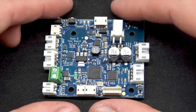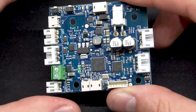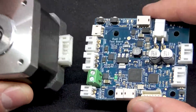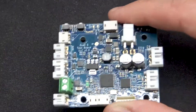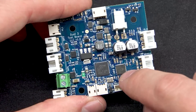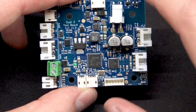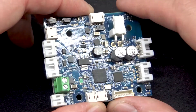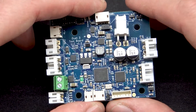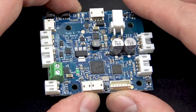Going up close and personal, you can see it's a small little board spanning 47 by 54 millimeters. Comparing that to a NEMA 17, you can see it easily fits on a direct drive setup. It has an ARM Cortex processor to control everything on the board and a Trinamic driver for your extruder motor. The connectors are quite different and I'll get into that in a moment, but it comes with 10 different connectors which is not something usually done on the motherboard itself.